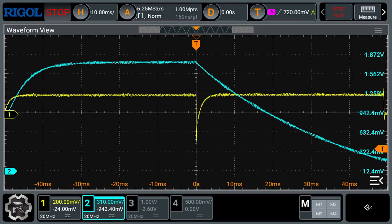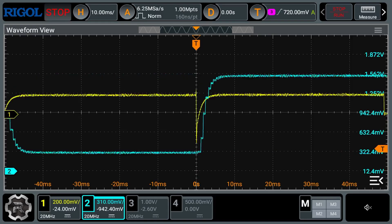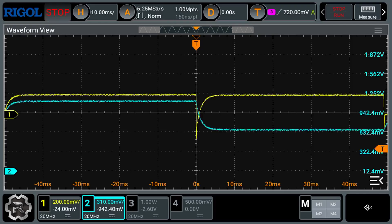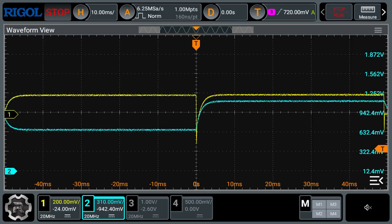Both boards have ICs labeled 93L43, so maybe they are the same boards — I'll have to see what the resistors and capacitors read. Here is the fall time for the K-Silver, which is much faster than the GenFull sensors. Could it just be the resistors and capacitors on the GenFull? The K-Silver has fairly well matched rise and fall times. The Favor Union fall time is the fastest of this lot, but the output signal is very low — the same magnetic field was pushing the other sensors to almost full output, so this sensor needs a much larger magnetic field. I'm quite sure this is a different sensor; there is just too much difference between them.